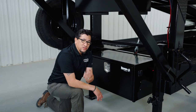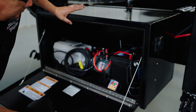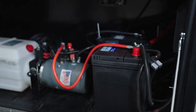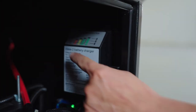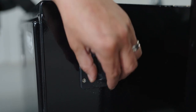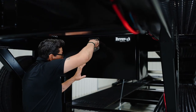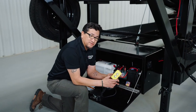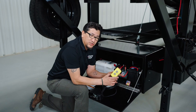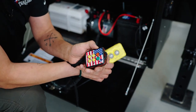Your trailer comes standard with an underbody lockable toolbox. Inside you have a 12-volt deep cycle marine battery along with your hydraulic pump that takes 32-weight hydraulic fluid, and a 5-amp charger. On the side of the toolbox there's a 110-volt outlet to charge the battery overnight at home. You can also purchase an additional underbody lockable toolbox where you'll store your straps and ratchets. Also inside is a 15-foot power cord used to raise and lower your 3x30 dual-acting hydraulic system, plus a remote control used for the same purpose.